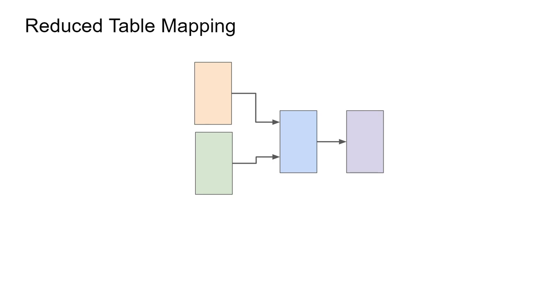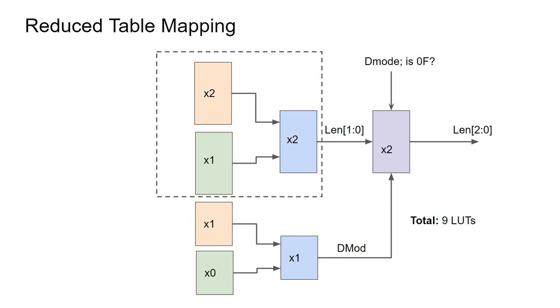So this is the mapping that we get — a total of 4 LUTs. However, since the lengths can still vary based on the processor mode, we need three copies of this table. Two copies are needed for the 2-bit length value, one copy is needed to evaluate if the length for a given opcode is affected by the processor's data width mode. Then two copies of the output multiplexer are needed to select and compute the output sum. That gives us a total of 9 LUTs per pre-decoder, with a propagation path length of 3 LUTs. The number of LUTs is lower than you might expect, due to the fact that the LUT6 can have two outputs, something we needed to combine them.